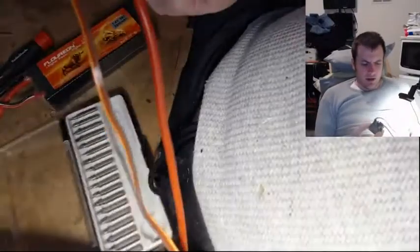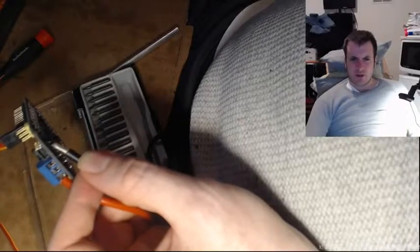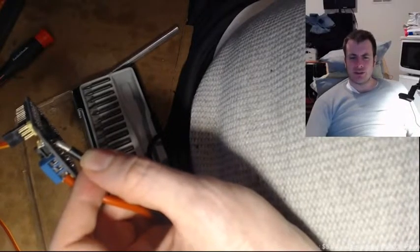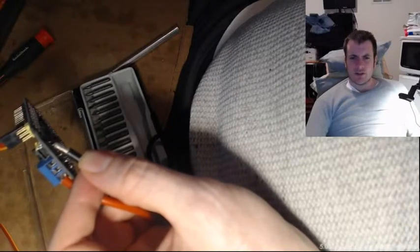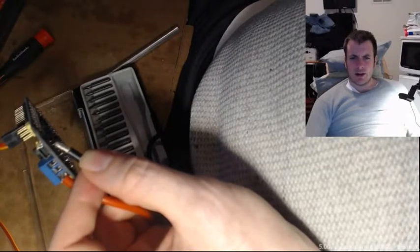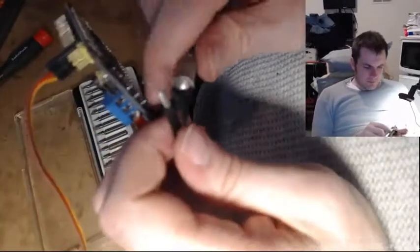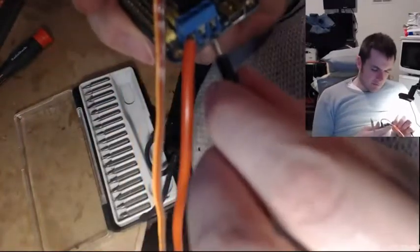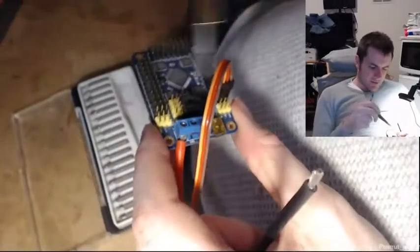Let's see if that's thinned out enough. What type of wire is this? Silicone... 12 AWG. Soft silicone flexible wire, copper cables for RC — black. Okay, so that's what I ordered. I'm going to verify that this will fit in this port now. I've got to loosen the screw first.